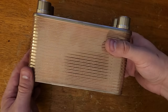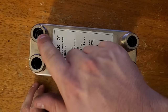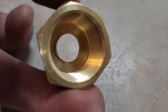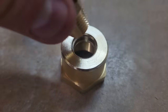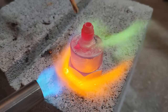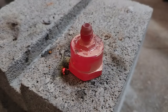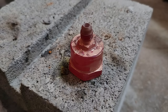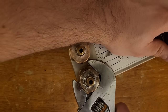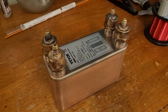The intercooler is a plate heat exchanger, which is basically just a series of closely stacked plates that have very good thermal contact, but the two sides are sealed against each other. To connect it to the system, I'll use ¾ inch caps which will have ¼ inch flare fittings brazed onto them. Holes are drilled, flare fittings are inserted, then I start brazing. I made four of these fittings, then slapped them onto the intercooler with some thread sealant. I had to use my big wrench to get a good grip on them. The braze joints are a little ugly, but ended up working pretty good.